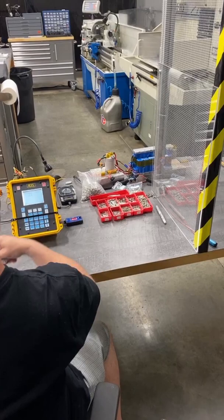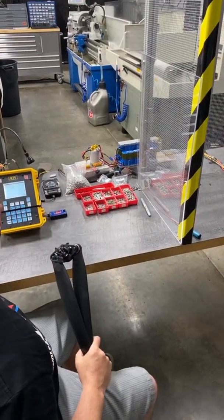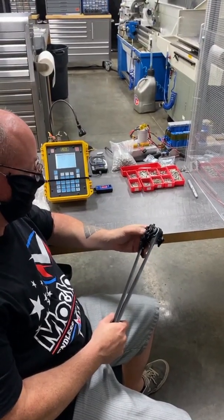How do you guys determine the tolerance requirements? Engineering during the development process of Alta-X picked different thresholds for vibration and tested against those to make sure that at those vibration levels the footage looked good. It's a guess-and-check type thing where we take a guess at what an acceptable vibration would be and validate it in the real world. Our current threshold is 0.2 inch per second. Even without this balancing, the Alta-X vibration isolation system means footage still looks very good — we do this mainly because added vibration reduces the lifetime of all the components and adds wear and tear.